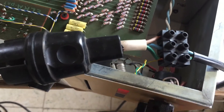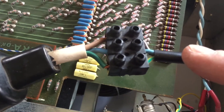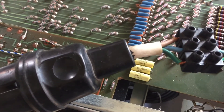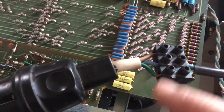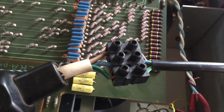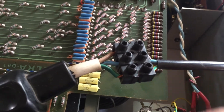This is always a bad idea, but I learned something today. You always have these exposed wires — a point where the plug can break. If you have to connect like this, don't strip the wires. Just feed them into the holes, plastic and all, then screw down the little screws, piercing through the plastic insulation. In Dutch we call them 'sugar cubes' — I don't know the English name — but it's a great invention.